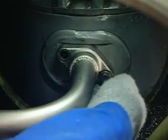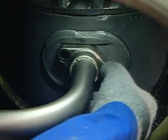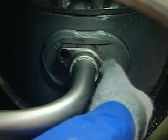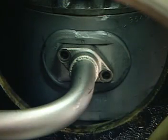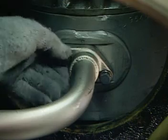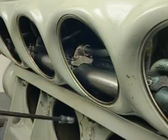Prior to torquing the liner-to-tube bolts, remove the two bolts from the flange. If the tube moves, it must be repositioned on the water manifold. If no movement is detected, the liner-to-tube bolts and washers can be reapplied and torqued to 30 foot-pounds or 41 newton meters.